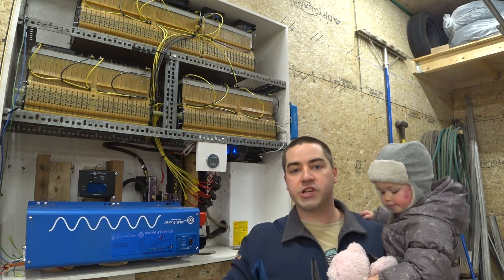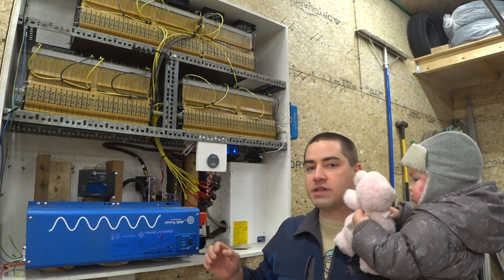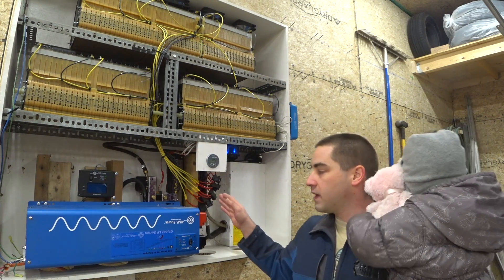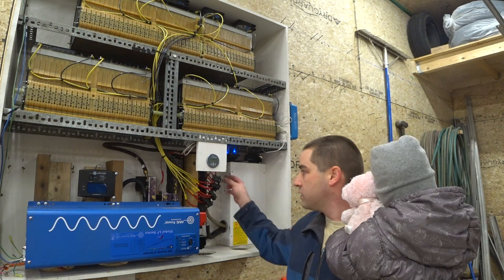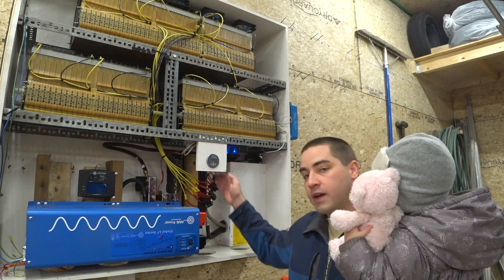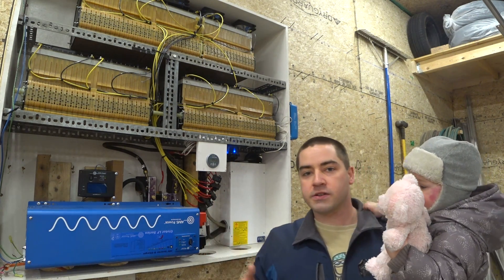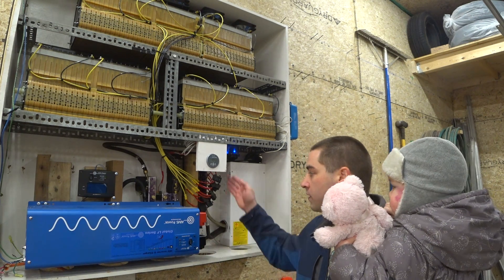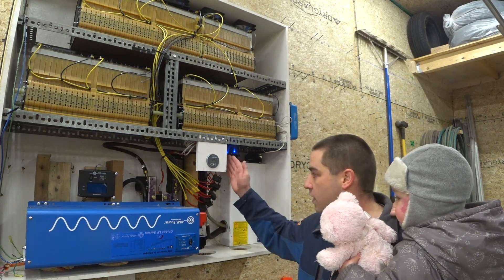When I took this out of the car it was originally designed as one giant battery, but I broke it into eight smaller batteries, each one with 12 cells. That's why I have eight positives and eight negatives coming down to my two large bus bars. Each individual battery is fused with one of these small fuses inside these cases. The aluminum bus bars are sprayed down with a protectant to keep them from oxidizing — they didn't cost me anything because I had scrap aluminum sitting around.